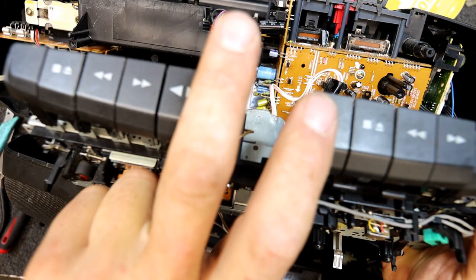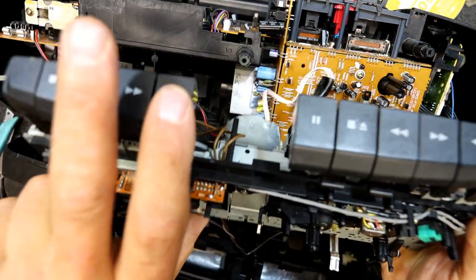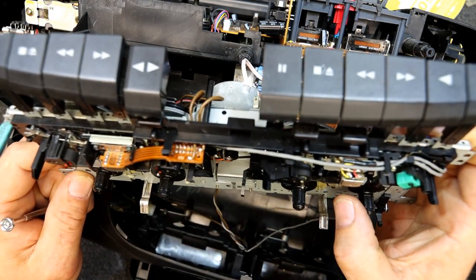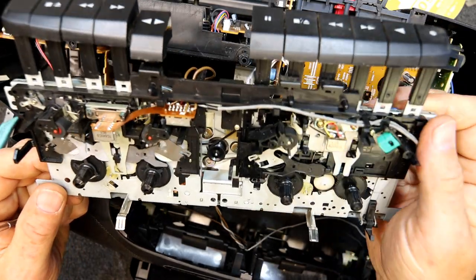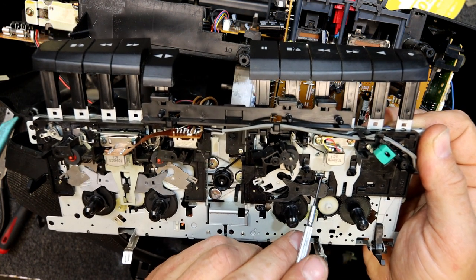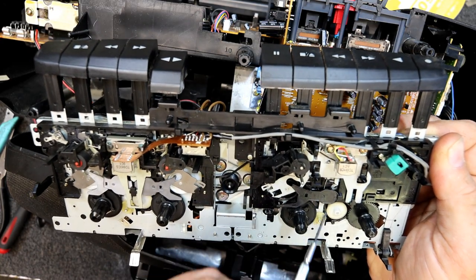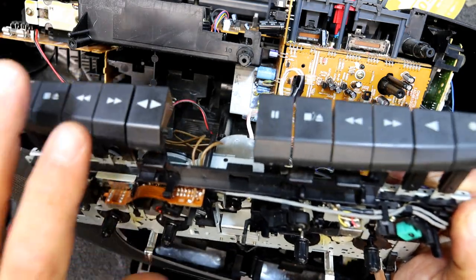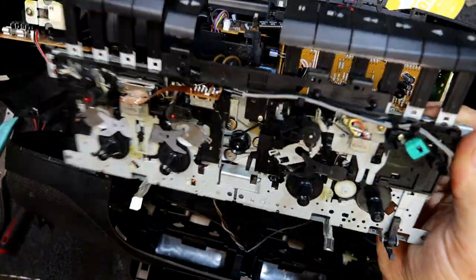Stops, pauses, run that side, nothing. So I've just put a slight bend in that little metal spring where it comes up, so it bends towards that, so it's the same as being pushed further this way. But it was sitting a bit high when I first tried it, and it was still clicking. Now it seems to behave itself.